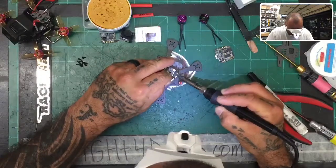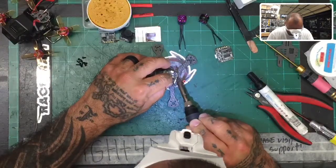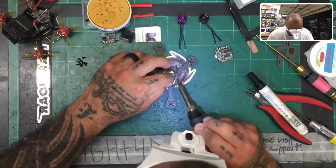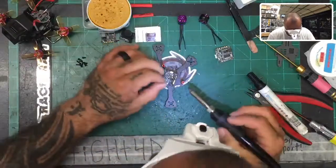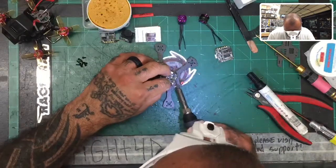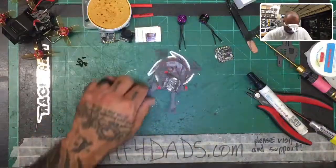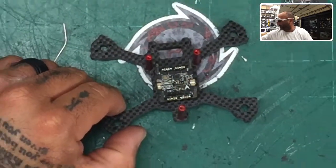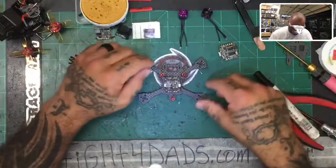When they come together, it's going to make a nice solder connection. So let's do another one: there's one, two. And if you're having a hard time reaching the solder pad, sometimes if the flux has not dried you'll have a little bit of a hard time. There we go — one, two, and three right here. Everything looks like it's ready to go. We can zoom in to show you — we've got our solder all the way around on each of the pads. Now we're going to go ahead and put our first set of motors down, and that's pretty much it for step two.